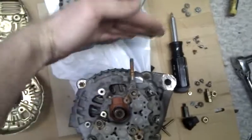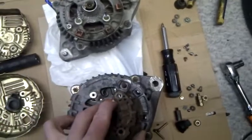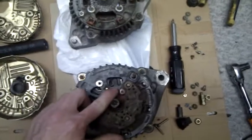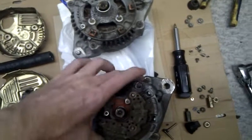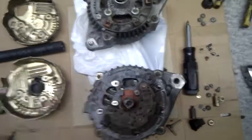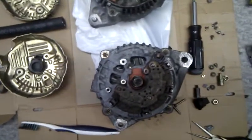The problem with the straight-up post: when it's sitting on the alternator, it goes straight up and this side bumps the hood. The ST204, 5SFE, off of a 95 Celica — this post points towards the exhaust manifold, which is good, which is what I want, because I don't want it to touch the hood, rub through my insulation, look bad, but mainly I don't want it to arc on the hood.